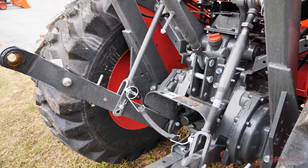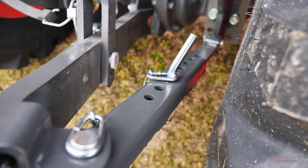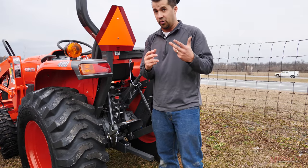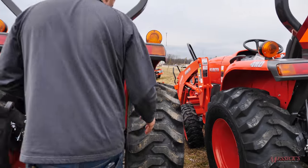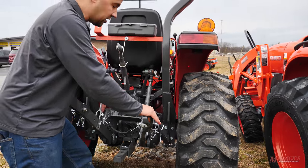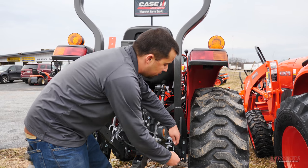The better way to do these is with sway bars. Kubota's Deluxe Series tractors are going to have these as standard equipment, but fortunately they do give an option to put the kit onto your standard L-Series tractor. If you've got that L8430 kit, your three-point is going to look a little bit more like this, where you have a sway bar here in the rear.